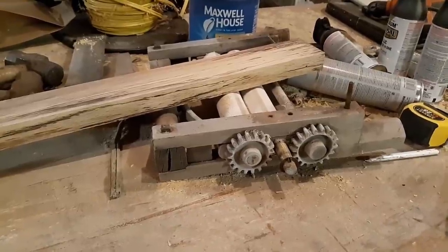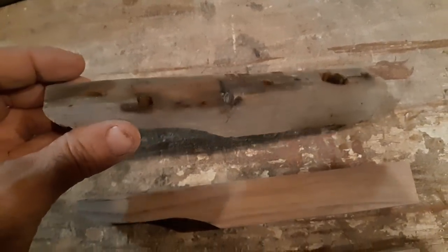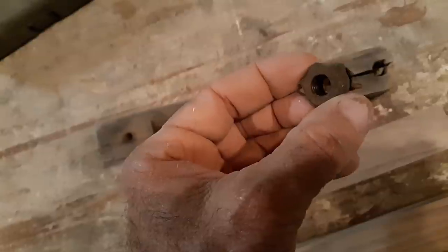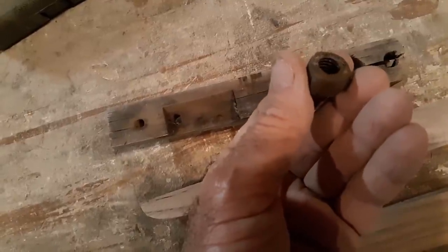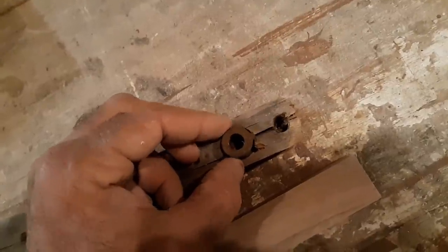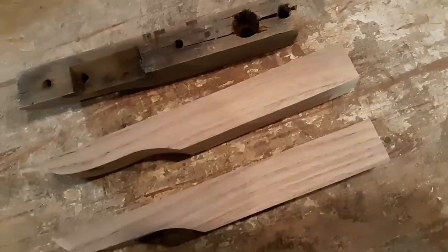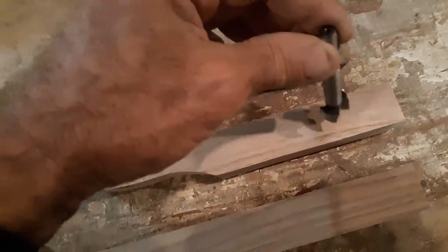So I'm having to rebuild every part of it. Here's the first part right here. These are the pieces that came off of it — they were really in bad shape. There's a nut that goes down inside here. It's a self-holding nut that goes into wood — it's got these ears on it that goes down in the wood. I was able to salvage them and get the pieces out without stripping them. These actually fit down inside here. What I've got to do is drill these things here, and what we're going to use is a Forstner bit.